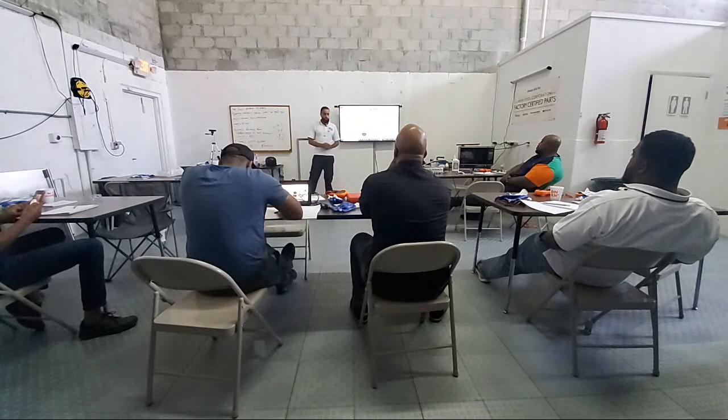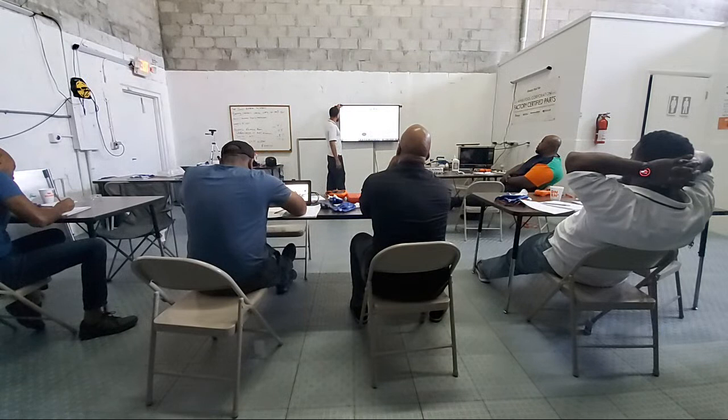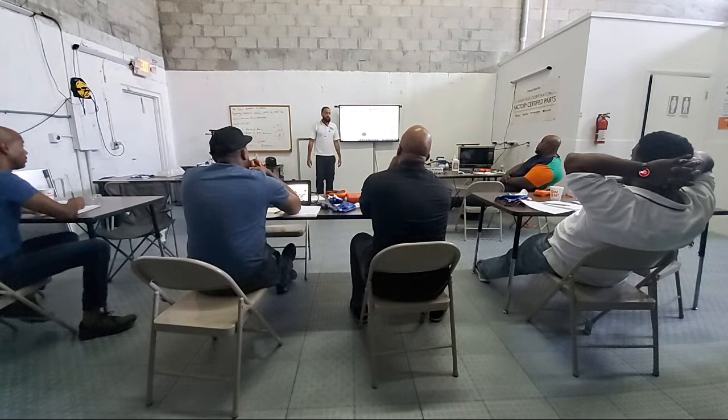To be clear, if we're trying to flush the whole system, we can actually cut the high end. Nope. Easier than that. Remove the filter dryer altogether. And now, guess what? Let me clear some of this up.